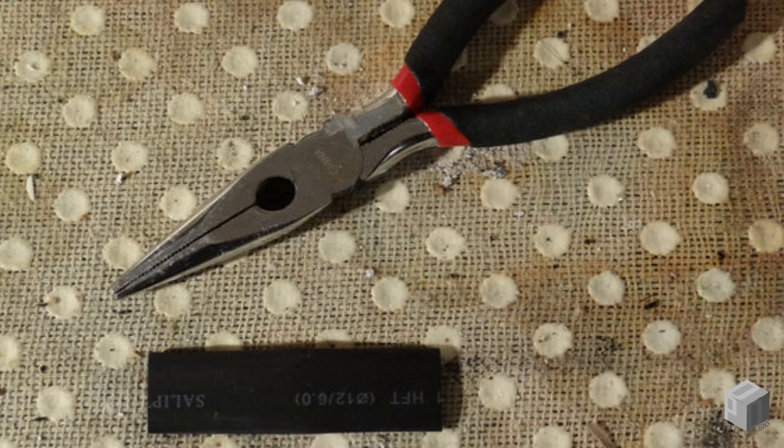To ensure a tight fit, we have selected a shrink wrap that is slightly smaller in diameter than our washers. We will need to stretch it temporarily in order to insert our washers in paper squares. Insert the needle-nosed pliers and open them slowly while working them around until stretched to 110% in diameter. Repeat on the other side. A washer should now fit snugly when placed in the tube horizontally.